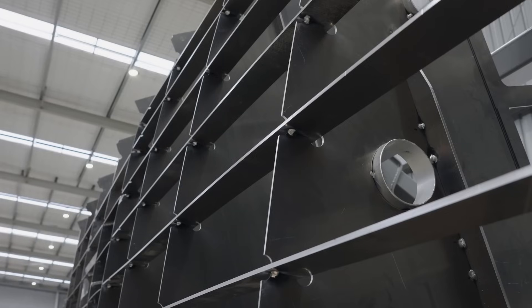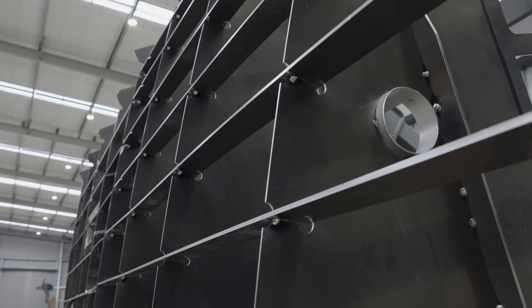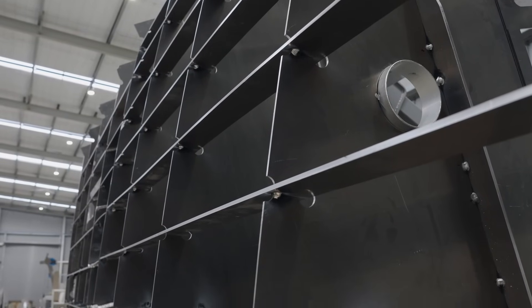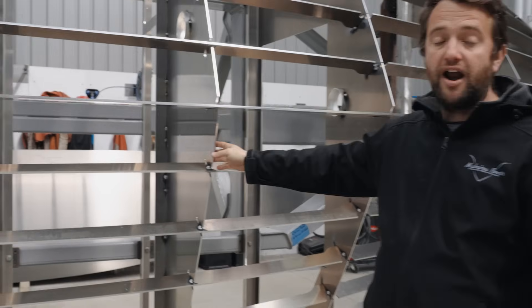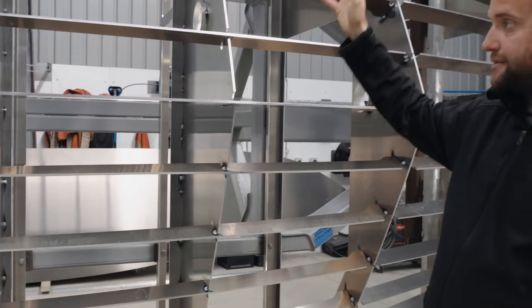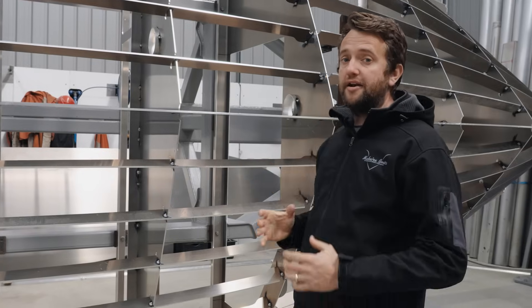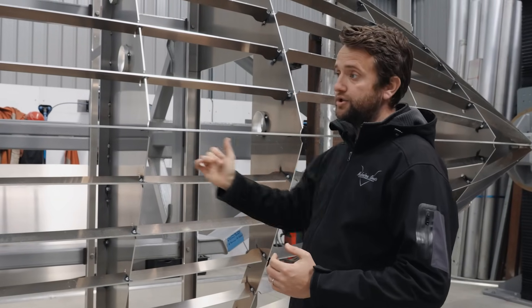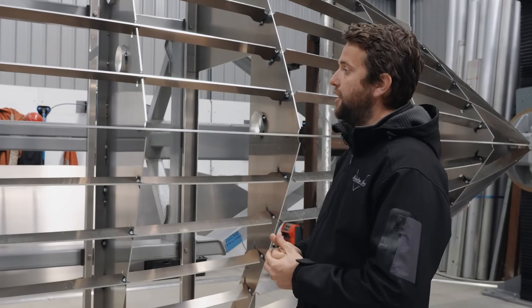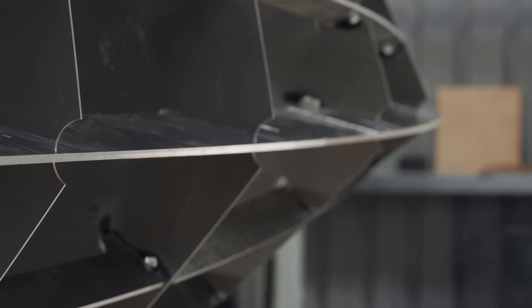You can see here behind me we've got a 35-foot hull on the jig. Some of the main terminologies we use in boat building are hull frames — a frame is a member that goes across the boat — stringers, which run longitudinally, and in some of our smaller boats we run full height girders, which also run longitudinally down the boat. And a keel bar, which is basically the backbone of a boat.